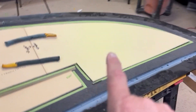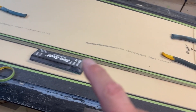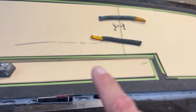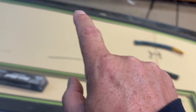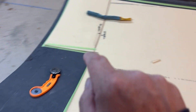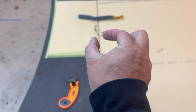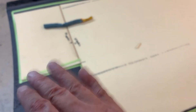I got that tip piece fit up - that went real quick. Now the next thing I have to do is sand all the edges to about a 45-degree bevel all the way around. Where I have a seam, I have it marked 'no bevel' - I made that mistake on the other skin. Those seams get buttered up and the natural squeeze-out from the resin and cabosil underneath and on top will fill that gap, so those panels just get taped together temporarily when they go in.